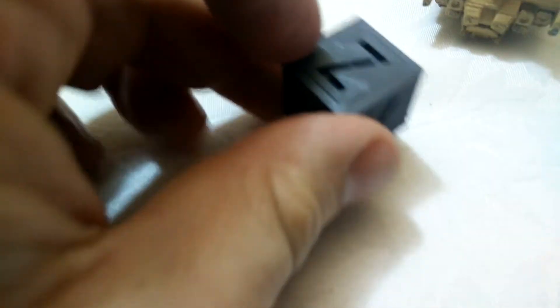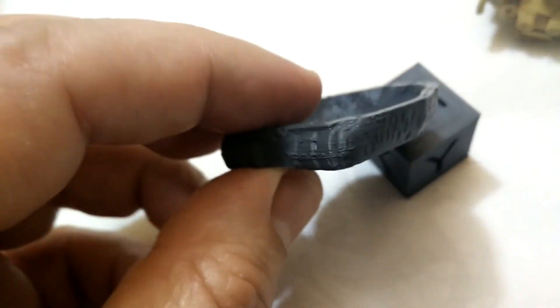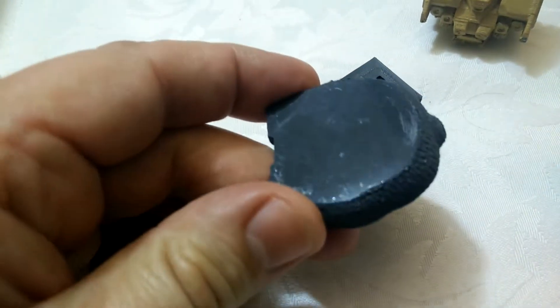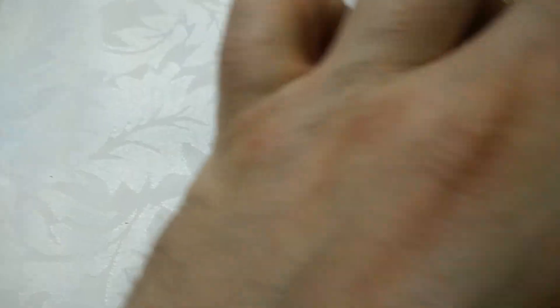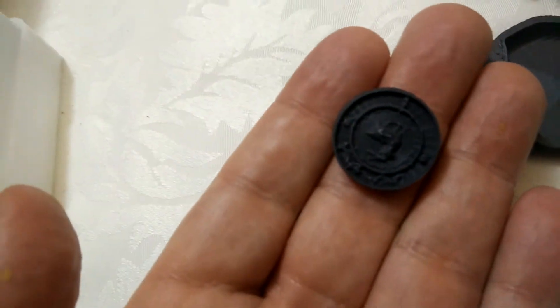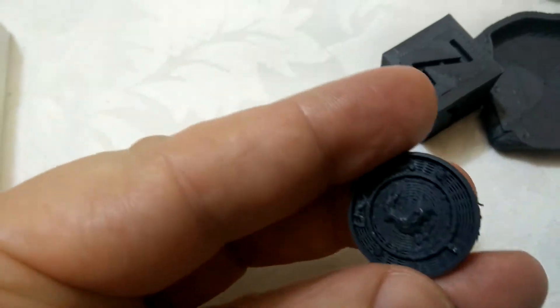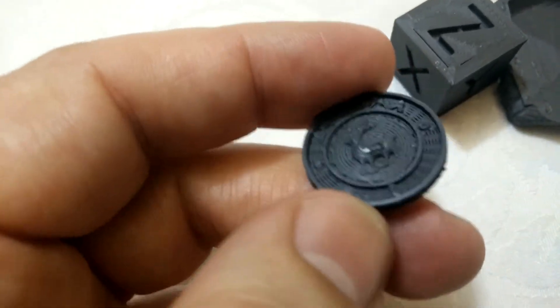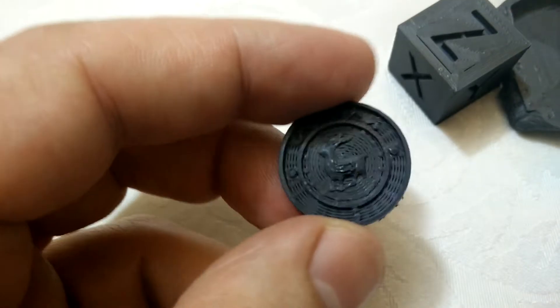I've tried several different prints with this material. There's an XYZ cube I did at 215 degrees — a little bit of a gap and some ghosting started to happen, but not a bad print. I tried starting the cat but chickened out and cancelled it — that was a 0.5 print. I've also done a little coin off Thingiverse which showed I had a little bit of under extrusion, so still tweaking away. There are some test prints I ought to do, but I'm actually trying to print out things I can use.